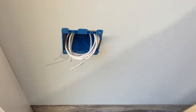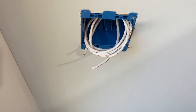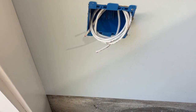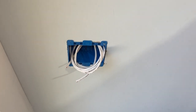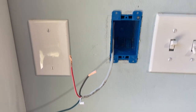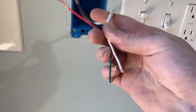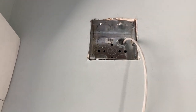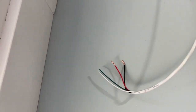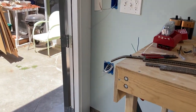So now we're finished, and here is the result. Down here I have a box just to connect things together — we're going to put a little plastic flap on there so the wires can come out. Eventually I'm going to connect this to the system in the garage. Here's the pull station box — the wires are stripped so I can go ahead and wire that up pretty soon. Here's the notification unit box — this one's metal just because it fits the holes for the alarms easier. And obviously here are the wires for that. So there's the setup — now I just have to install the devices and wire it up and we're good to go.